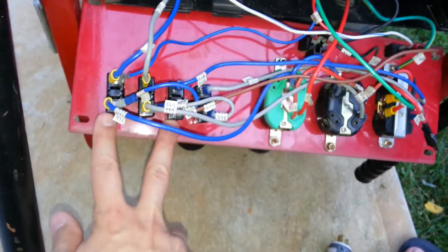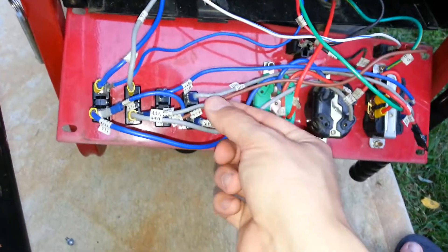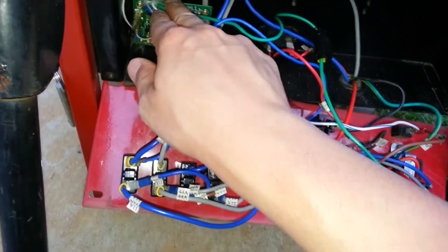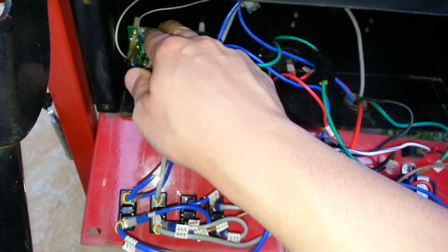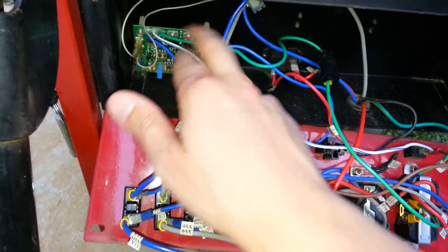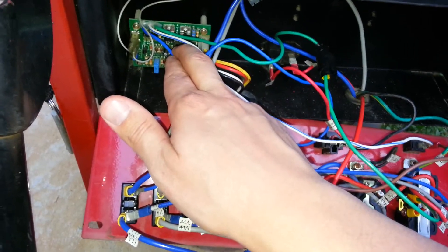Just a quick tip: these two are jumpered together, and these two are jumpered together. So one winding plus the second winding gives you 240 volts — just something to keep in mind. The primary winding, the first winding, is the 120 volt side that should be powering the system control board — 120 volts AC to run the voltage regulation circuit — and also the 120 volts on that same winding powering the idle control solenoid. These two wires are for the idle control power.